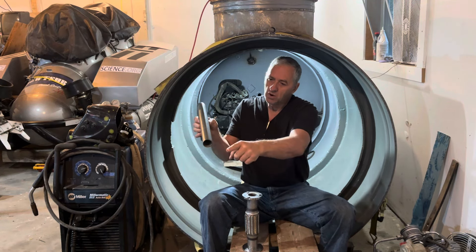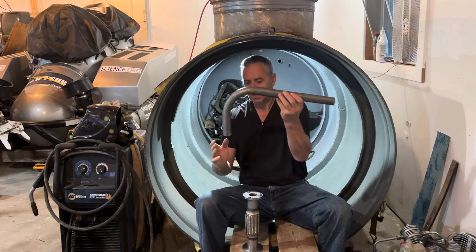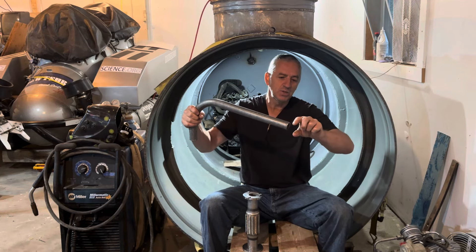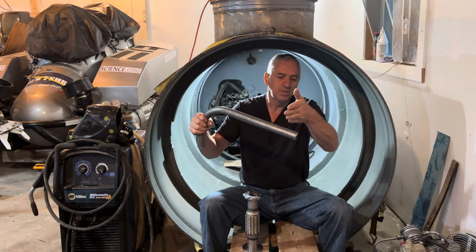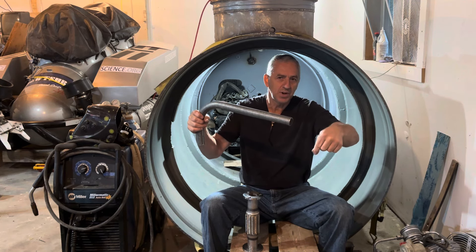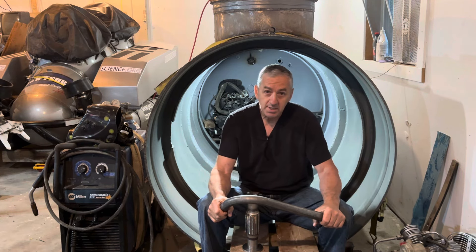The reason I want it to be more than 90 degrees is probably obvious — I don't want water to be able to back up and down into the manifold, so I want it to go downhill. This comes up and then goes downhill. At this connection point, I'll put a T — probably just a little past it because there's a rib right here in the sub. So I'll have a T intersection with a drain in the bottom and a small reservoir.